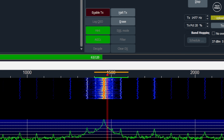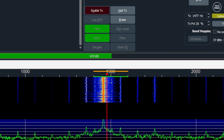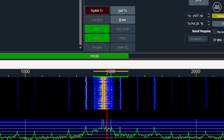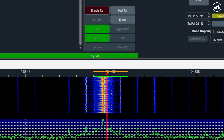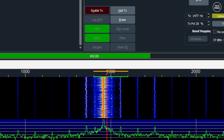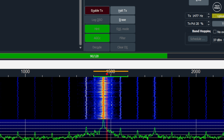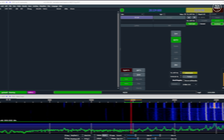While it was transmitting I had my radio on with JTDX running to decode my transmitted whisper transmissions and see where they were taking place. The green bar on the JTDX waterfall indicates the 200 Hz portion of the 40 meter band where whisper transmissions should be placed. If your transmissions are outside of this area, you can use the calibration settings for the selected band in the web interface. I used around plus 600 Hz for the 40 meter band, but with the same hardware yours might be different — it's well worth checking.